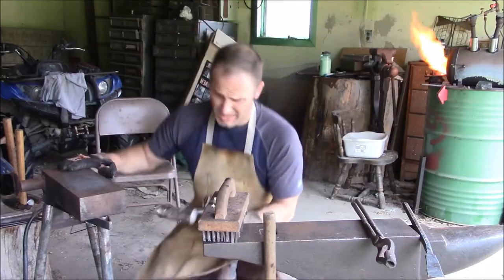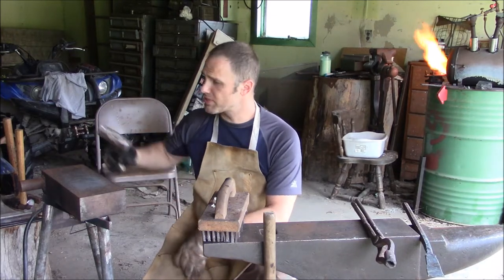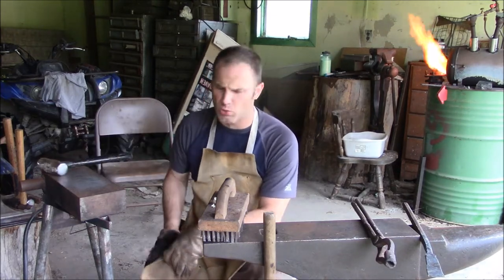I think they're getting up to a high enough temperature, but I'm not getting my hammer strikes in quickly enough before certain portions of the billet cool down. I'm even preheating the anvil so hot you can't lean your hand on it. So I'm hoping by splitting this one billet into two smaller billets I'll be able to get those to weld. These billets were originally completely encased so they shouldn't have gotten any oxygen while hot. This time — two-pound hammer — I'm going for speed, to get those things to weld before the outer layers cool off.